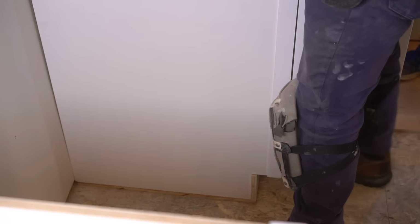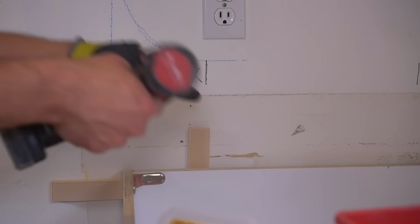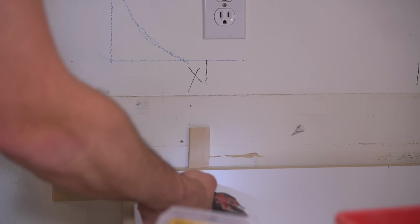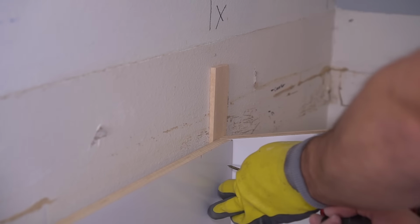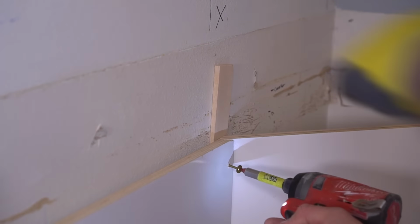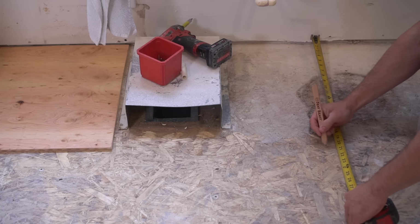Now this base cabinet is the corner cabinet and is actually quite important. Everything works off of this, and to make sure that it aligns properly with the upper cabinet above is extremely important because it's right next to our oven. I level out the base cabinet and quickly realize that some of these walls are not perfectly straight, which is why I do have to shim out the back side in some locations, but it's nothing that a couple shims can't take care of.